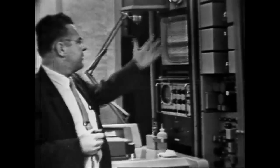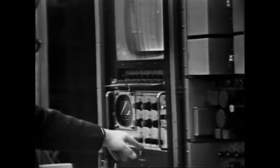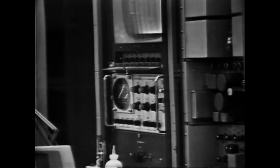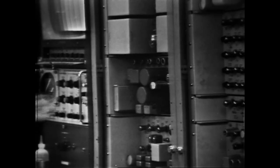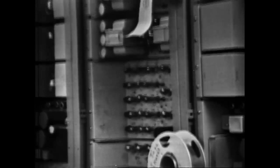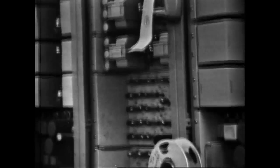As I mentioned earlier, the racks contain the gear which runs the machines. To operate this particular machine, we have first the rack which contains the Conrac video monitor, the 525 waveform amplifier — which is a Tektronix scope — the audio amplifier for monitor purposes. The next rack contains power supplies, the master control unit, the capstan servo unit. The next rack over associated with this machine contains the power supplies, blanking switcher, switcher, modulator, demodulator, process amplifier, and the autocomp mechanism.